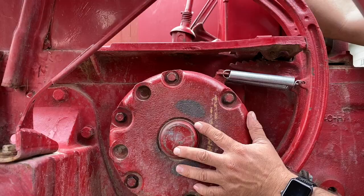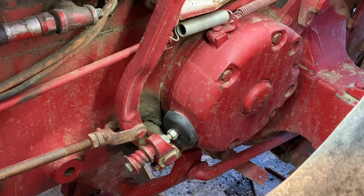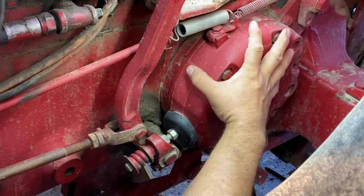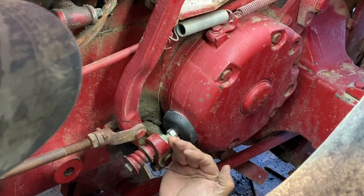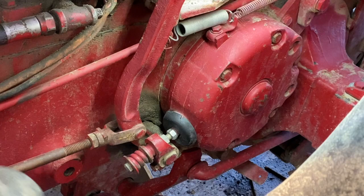So we'll start taking it apart and go from there. Now we're on the left side of the tractor and we'll start taking it apart. The first few things we've got to do: take off these two springs because they're connected to this casing right here, and we're taking this whole casing off, so the springs have to be removed. Then we will have to remove this part for the actual brake pulling. The lever on the right hand side pushes this down and it pulls this out, which actuates the inside and basically engages the brakes.